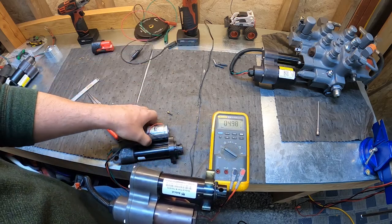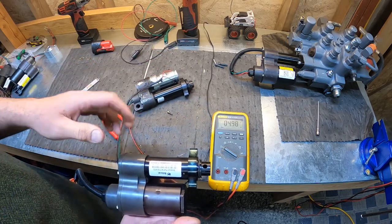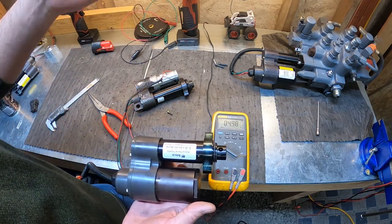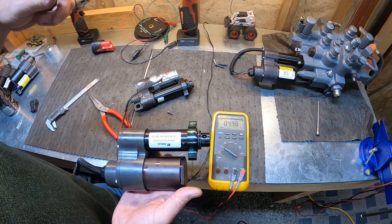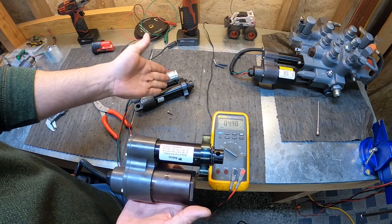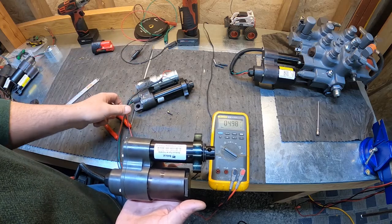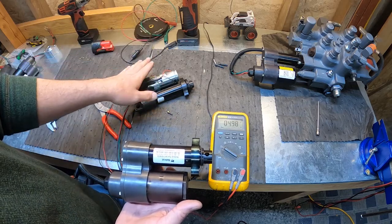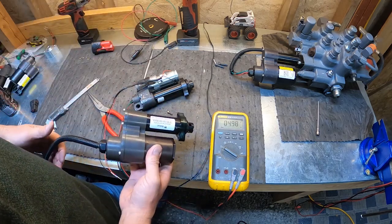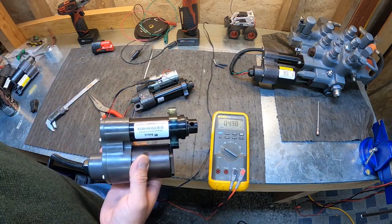Well, it needs to be slower because, like I said, this first generation of actuators with an AHC controller cannot be calibrated or updated. Yeah, I guess it can't be updated. So the AHC controller is measuring that speed. So if you put a faster actuator in there, it just wouldn't work. So that's why there's only 2 part numbers. One for the old style AHC controllers, and one pretty much takes care of everything else. So how do we calibrate this one? Let's get into one of these real quick.